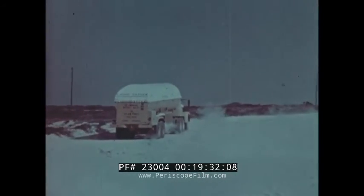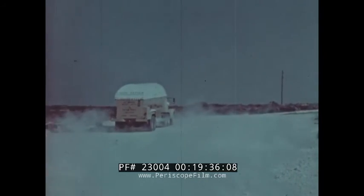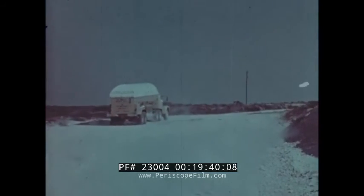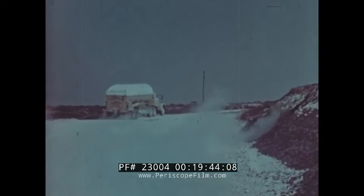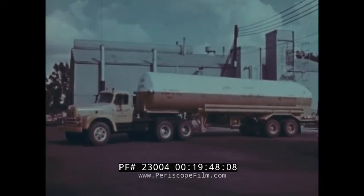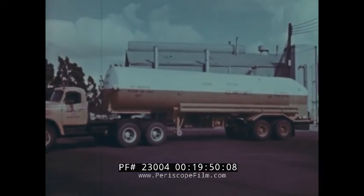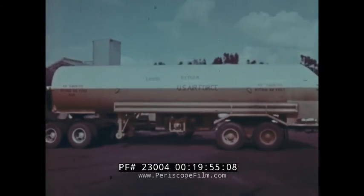The contaminated transporter, like the contaminated storage tank, must then be carefully purged with hot dry nitrogen, refilled with LOX or nitrogen, and samples again taken. If the samples meet specifications, it can then be returned to service and used again to transport LOX from the supply source to the operational storage tank at the launch emplacement.